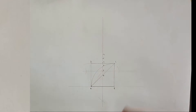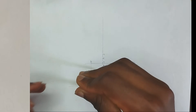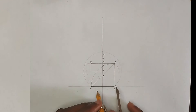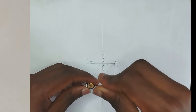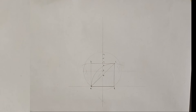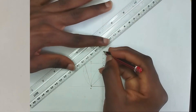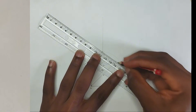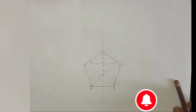Now I'm going to pick my compass from point five to point A and draw a circle — ensure you make use of chain lines to draw this circle. Then I'll place my compass at point B to point A, using the 40 millimeter length, and strike an arc, then place it at this point also and strike an arc. Using my ruler I'm going to draw the pentagon — the polygon of five sides — joining all sides together. This is our pentagon. Now we are going to move to the hexagon, the polygon of six sides.